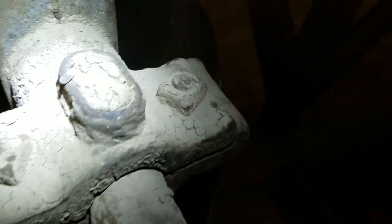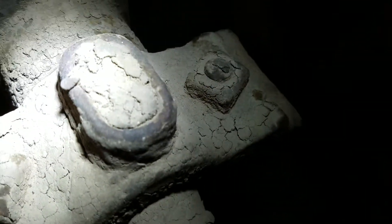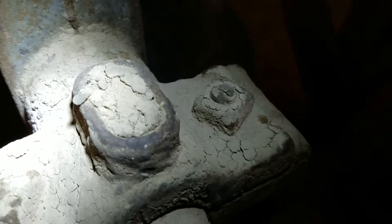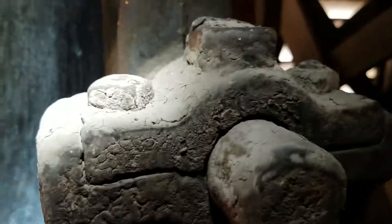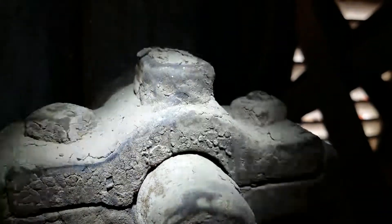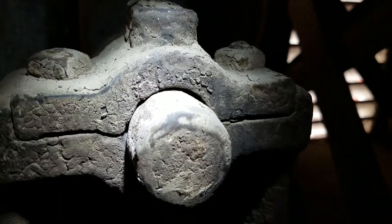Here's another good example on the first bell I showed you — that oval area is where the grease is put in. That's the pivot pin, and obviously that grease has not been touched in decades; it's all dried out and there's probably a lot of grit and dirt inside there. If you take those two bolts off, remove that cap, clean out that hole, and then repack it with grease, that really will help.